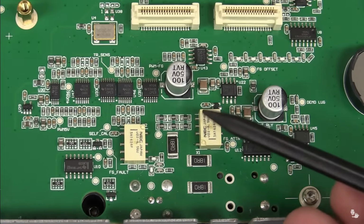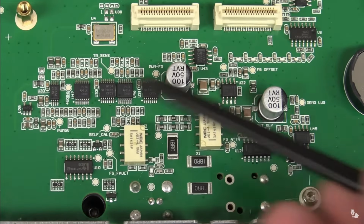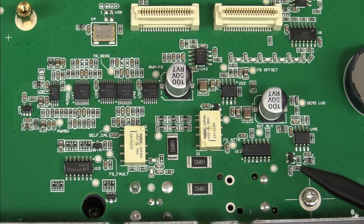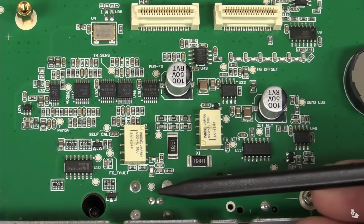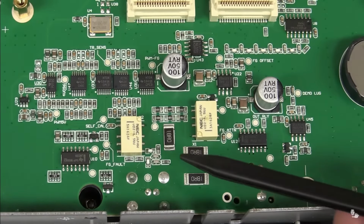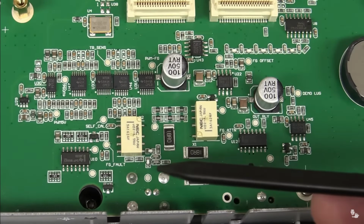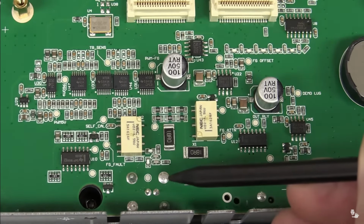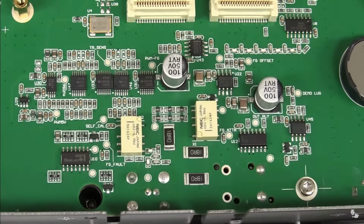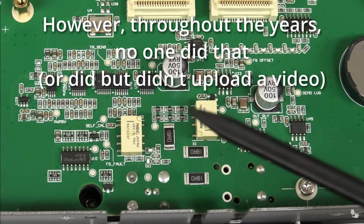And it's not really worth spending much time on the SigGen stuff. These are just amps and things like that to do offset and output buffering, and the demo signal generator down here. Now, this is the BNC. Now, they sell this as a non-generator model. I don't actually have the non-G version. The base price unit does not have the signal generator, and I am led to believe that it physically does not have it populated. So I assume maybe it doesn't have the rest of the stuff populated either. I'm not entirely sure, but we'll have to wait until somebody does a teardown of a non-G version.